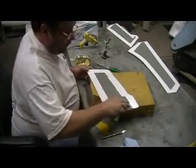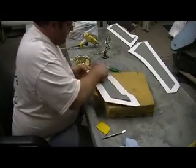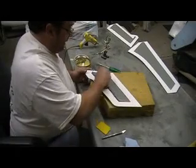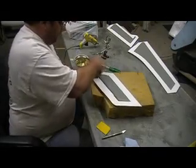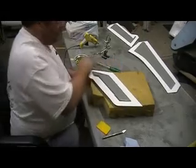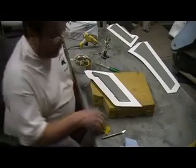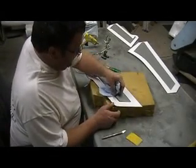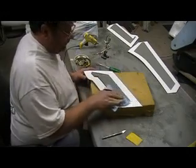Now I've got about a gallon of white resin left. I'm thinking I'm going to go ahead and use that on the, I think what I'm going to do is I'm going to try this method. I got a little bit of that harder white resin, you know, that expensive stuff. I got a little bit of this, that surface coat stuff. I'm going to put that in a pastry bag. I'm going to get my edges with that because that's not supposed to chip quite as easy. Just that plain white stuff. And try that method. Plus it dries a lot quicker. That stuff sets up a lot quicker than just that clear resin. And hopefully this won't be a 26-hour ordeal.